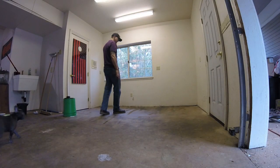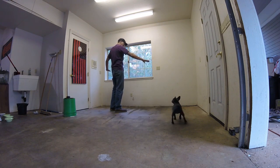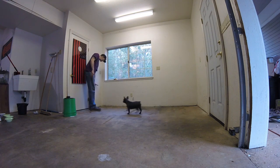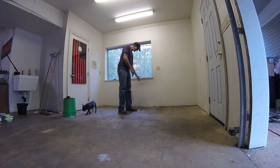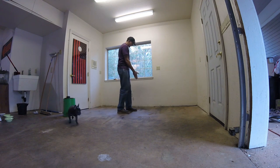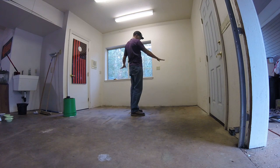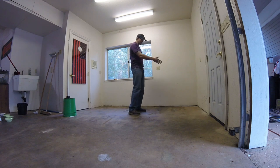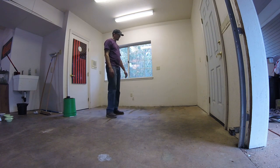All right, so this is the area that we're going to have it in, and we have two pieces that are going to go on the top. We're going to have those supported by a 2x4 screwed into the studs here. There's going to be a center divider that has a cap on it, and then a 2x4 on that side. We're going to put the two pieces on top of that and secure it down. And then we're going to put all four panels on the front here. So it should be pretty simple. We'll see what we run into as we go along.